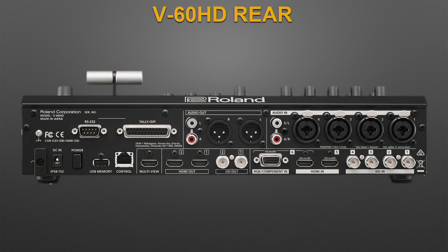Looking at the back, on the bottom right are those four SDI inputs — you can take in 720p, 1080i, or 1080p sources. Update 3.0 expanded frame rate support: 23.98, 29.97, and 60 are now supported by the SDI inputs and will convert to the 59.94 output. Note that 720p cameras require 720p output on those four inputs — they're not scaling. But if outputting 1080i or 1080p, you can take in both 1080i and 1080p on inputs one through four.